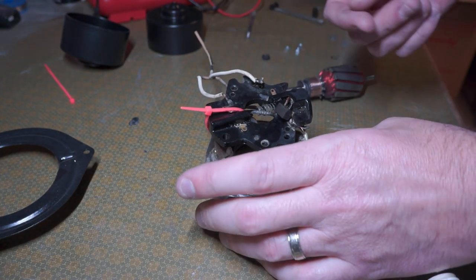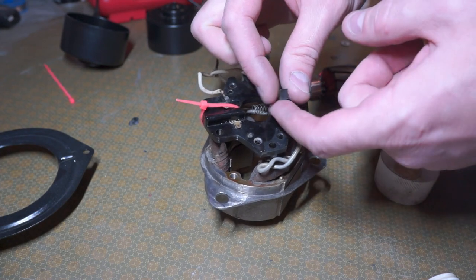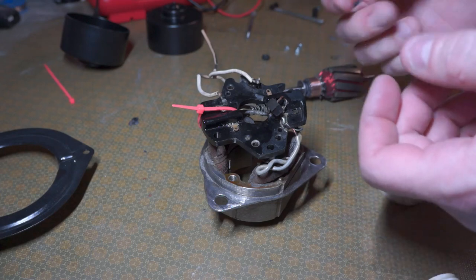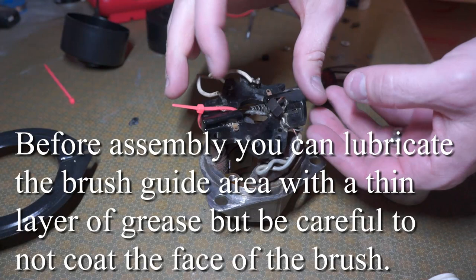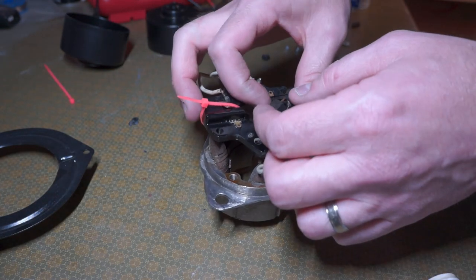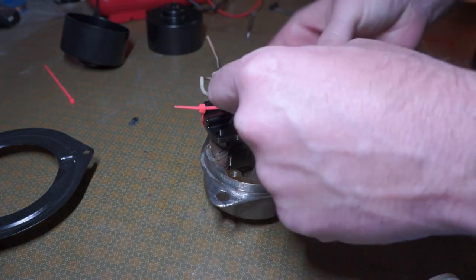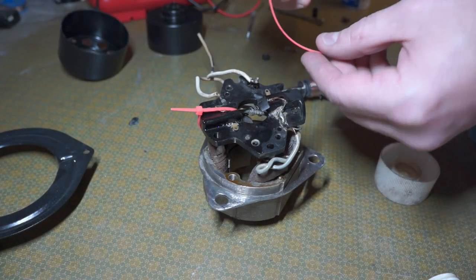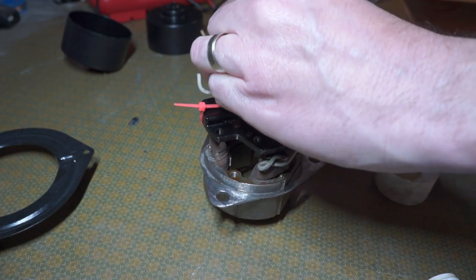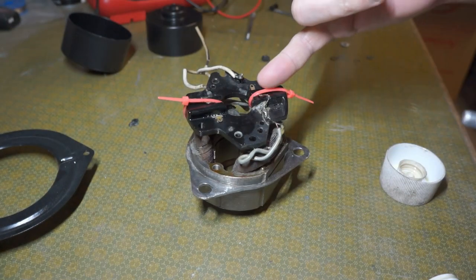I got it all apart and I'm now going through the process of putting it all together and refurbishing it as much as I can. I don't have new brushes to replace or new springs for the brush springs, so I'm just using what already came with it. You can see how I got these springs in for the brushes — it's tough to do with two hands, you basically need a third hand. That's why I got this zip tie on here: put the spring in, push it in with the brush, then put a zip tie around it to keep it together while you put the rotor assembly back into the center of the stator.